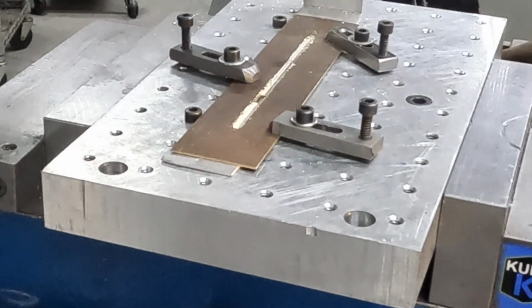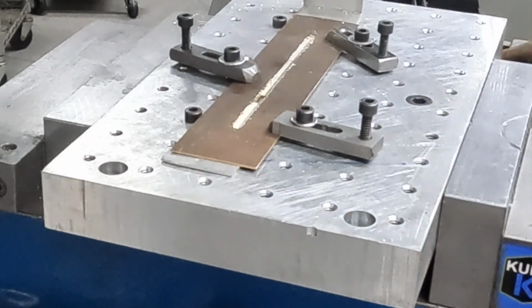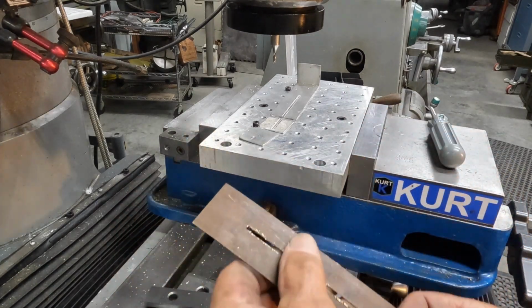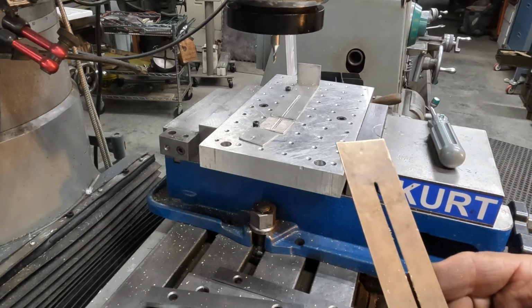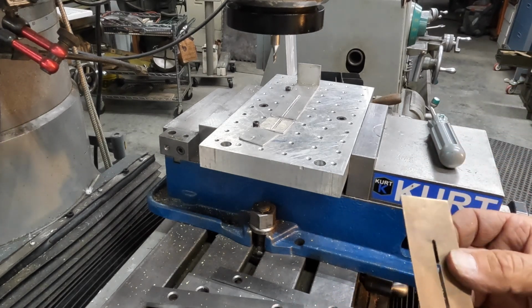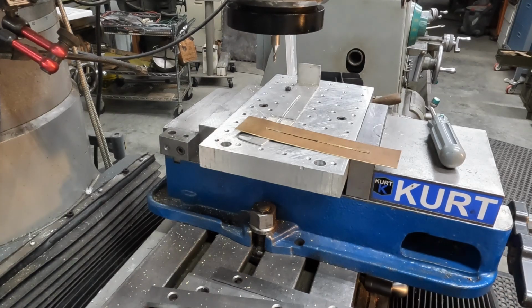My idea here is to pull that down, put a lip on it, so that the envelopes will drop through the slot. And it's going to widen out to the 5/16 opening. Okay, these ripped out. There's some rough edges here we'll have to get rid of, but what I'd like to do now is create a pocket in another piece of metal that we can push down and form this in one nice press. So I'll see if I've got a 5/16 ball mill.